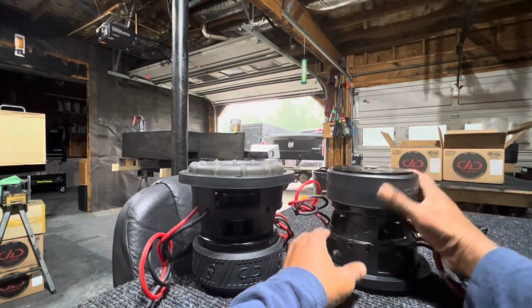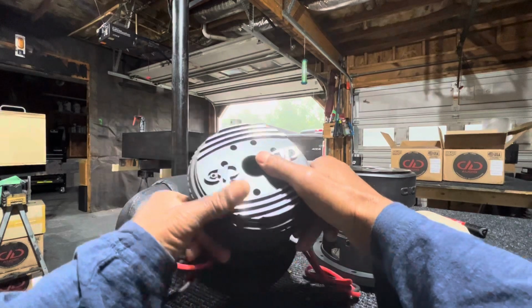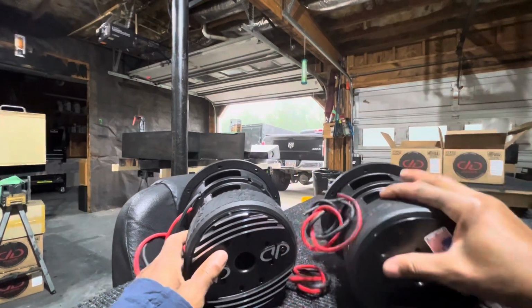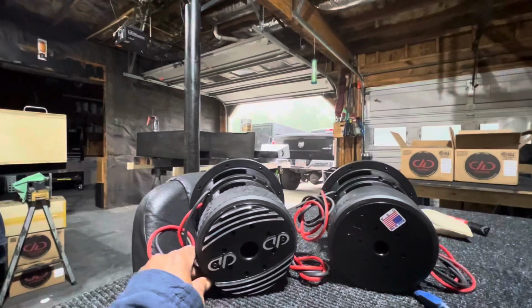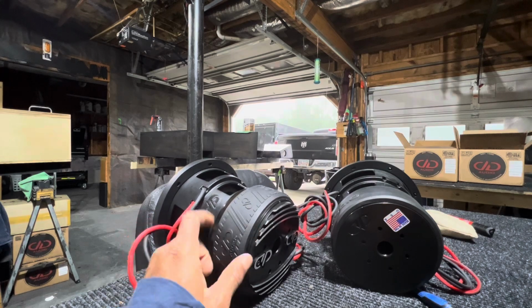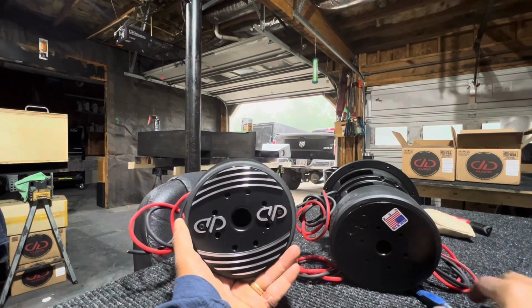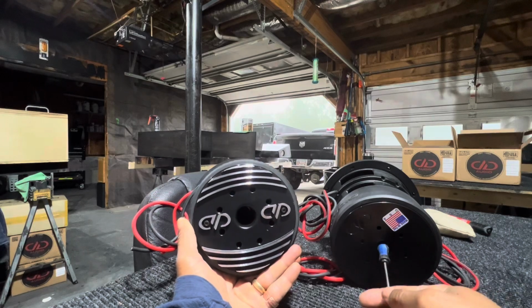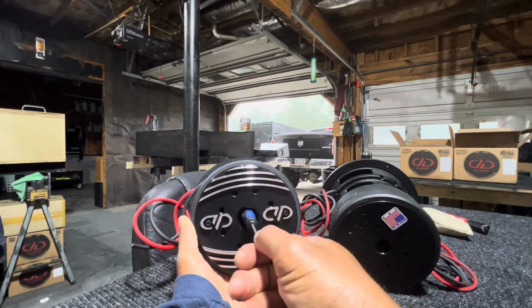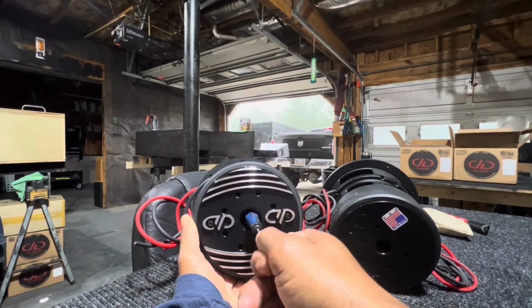Now, you can really see it this way. Let's take the 1506A revision and look at the size of its motor. Lay that back down so you can see this, the size increase slightly. He had to modify the back plate on the 1506A to accommodate these far larger vent holes. You can scale it here, and you see how it looks there, right? Now watch this. I got room to bounce around. I have very little room to bounce here. A lot of movement here.